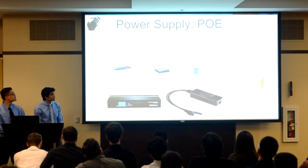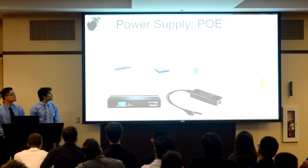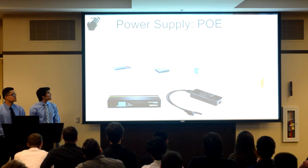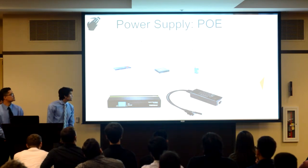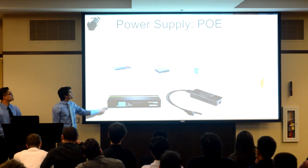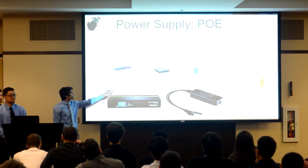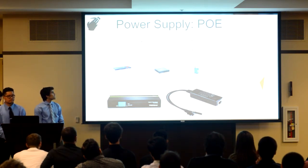But then our sponsor suggested a much simpler option, and that is the power over Ethernet method, which gives us 15.4 watts of power per PoE port and allows us to submit data and power through one single Ethernet line. Basically, how this works is you get an Ethernet cable connected to one PoE port and then the other end of the Ethernet cable connected to a splitter, which will then split the power and data lines.